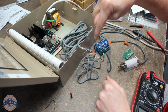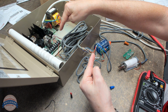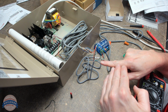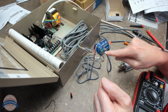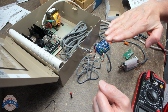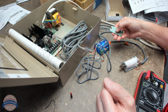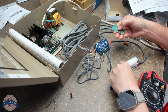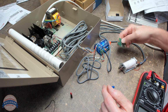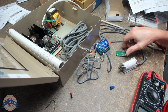You're going to pick up voltage into your common wire from the other leg coming from the power supply. That leaves two wires left. The normally open wire, which is really the light switch, on, off, has to go to the other leg to the load because that is what allows open circuit, closed circuit, which again is controlled by the receiver, the transmitter. There you go. That's how you pair and power a 10RD433.